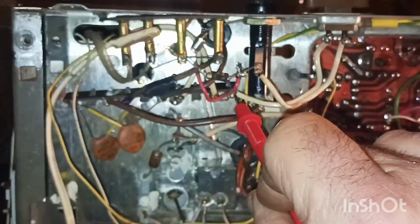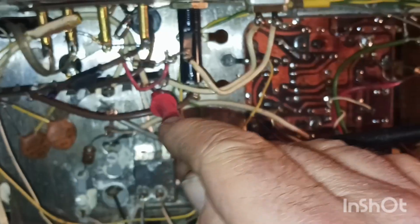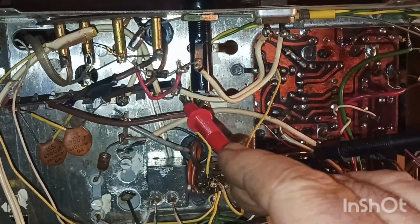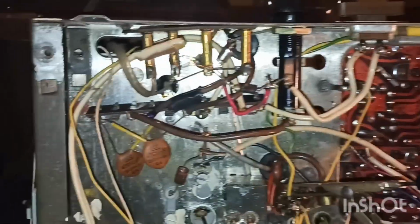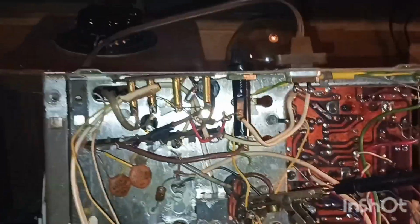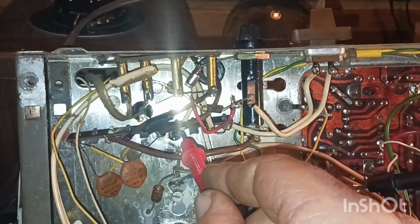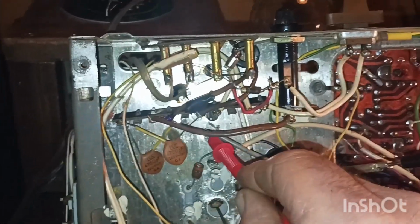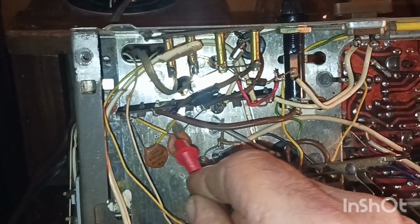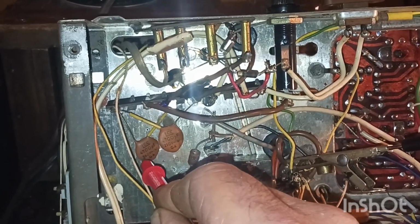And then on this line coming off, I'm having my voltage here. I've only been testing at 40 volts, so 40 to 50. So when I reference 40 or 50, that's not 115 volts. I'm just doing it for safety because I don't have an isolation transformer on my Variac yet. So I have 40 to 50 volts here and here, and on this first leg of this 4700 microfarad capacitor. On the other leg coming off, so far I don't have any voltage, and I don't have any voltage on this other 4700 microfarad yet.